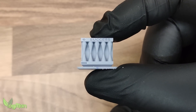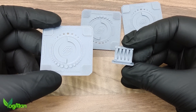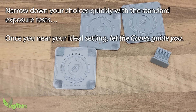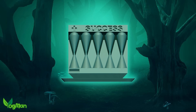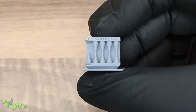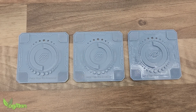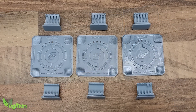Well, here's where you can use the cones. This is an ideal time to put your guesstimations to the test. If you're a little bit wrong, then there's no need to print another as the cones will tell you which way to go. So yes, the cones of calibration are genius and do have their place. If you're the very patient sort, then take a day or two of printing nothing but these. But if, like me, you want to get on with printing the good stuff, then use the standard exposure test prints and narrow in very quickly. Then, when you're close, finish off with the cones of calibration and check your guesstimations.